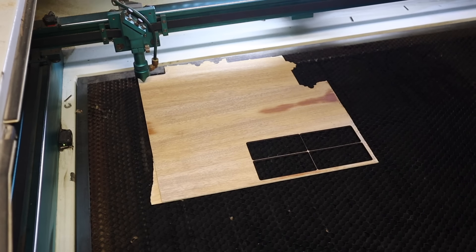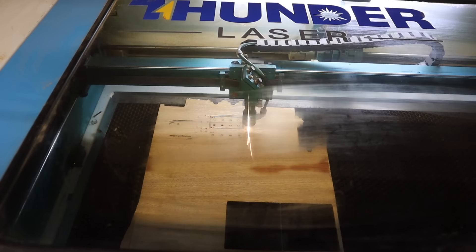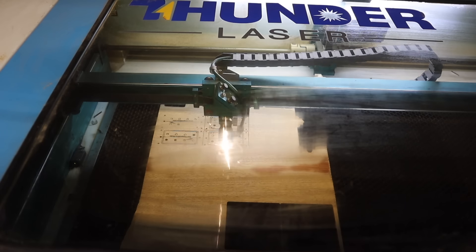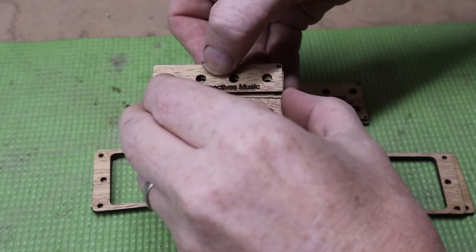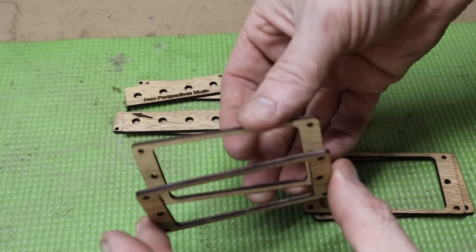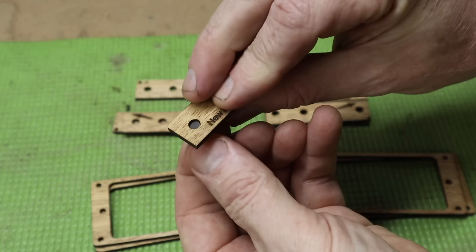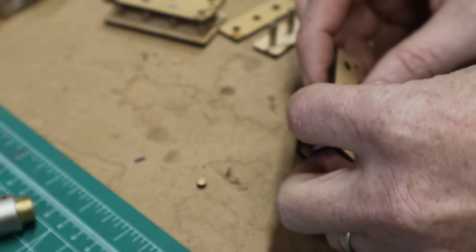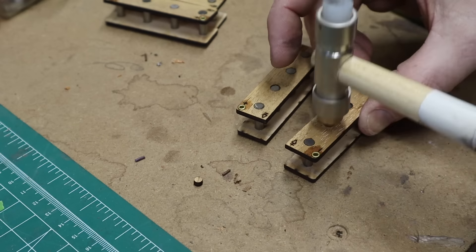The goal for me has always been to make as much of my guitars in-house from reclaimed materials as possible, and the pickups are an example where I'm making the bobbins from some reclaimed closet door scraps — one of my favorite materials. Some of my earlier pickups were more reclaimed than this one, but it takes a little bit of finessing to get all the sizes right. I cut two trim rings because I'll glue them together to make them a little bit thicker, and it took some guessing to get the right laser cut hole size — tight enough to hold but not so tight it splits the wood.